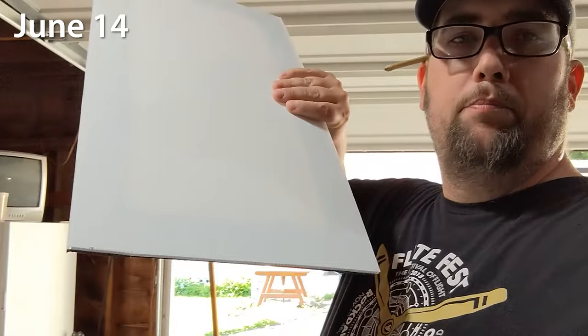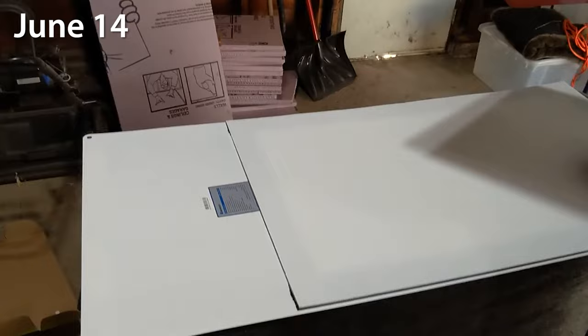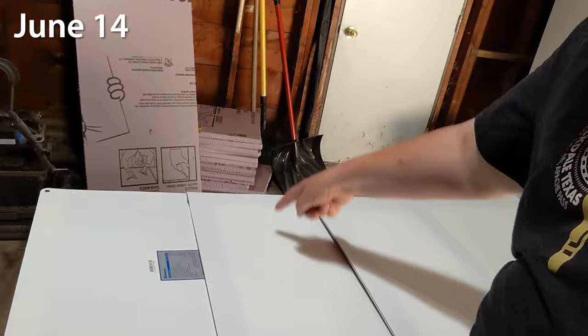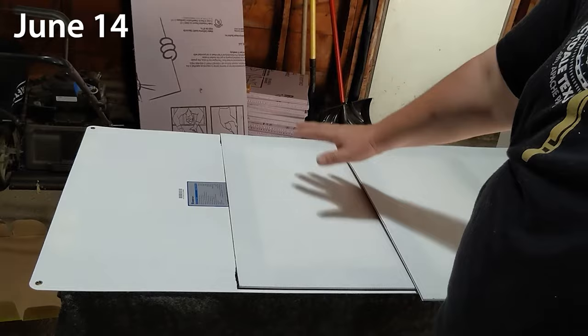plastic cardboard, or the plastic corrugated cardboard. It's got these holes in it that go all the way through for airflow. And I already have the first big piece on, and this is just the piece that's gonna go on the end. But the holes through the plastic cardboard, you want to go in the short run, because the air will get through it the best. The best airflow to dissipate the heat that could come from the sun being directly down on the panels.